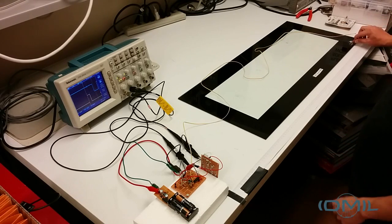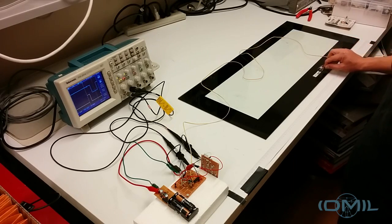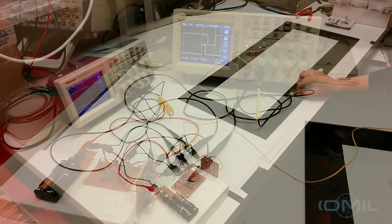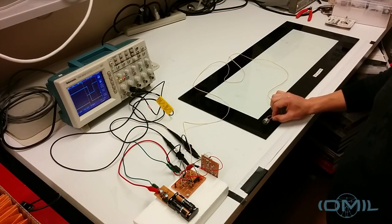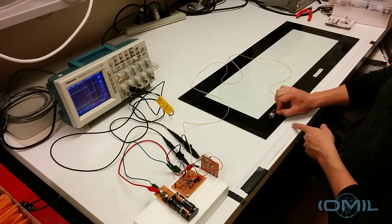If the receiver gets closer to the meter, you can calculate the time of flight of the trigger pulse and therefore calculate the distance between the transducers. For example, that's about one millisecond time of flight, which corresponds to a distance of about 30 centimeters.